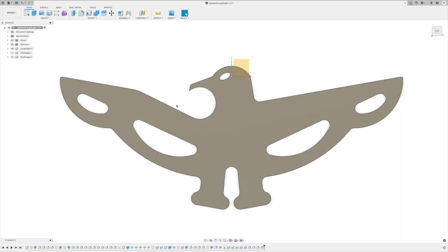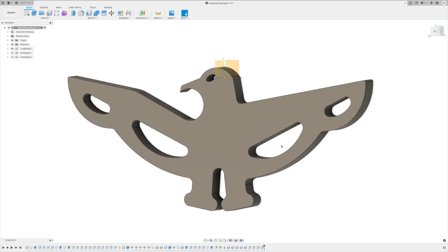And then right in here in the beak area is where I put the actual bottle opener portion of it. I just copied that off of any standard bottle opener I found in my kitchen. A 3/8 diameter hole seemed to be about right. There's enough room in here to get that over the top of the bottle. The overall design is nothing too complicated. I just made my sketch, extruded that out, extruded the holes through there, and used a series of straight lines and contours to get it shaped how I wanted.